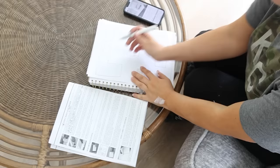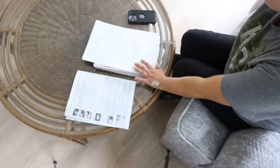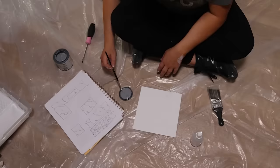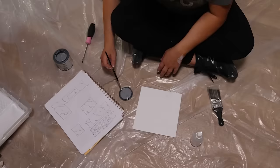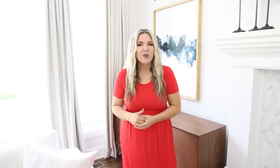While you're waiting for your primer to dry, this is a great time to research different marble pictures on your phone to figure out exactly the type of marble that you like. I actually drew out how I wanted the veins to look on my countertop. This was a really important step because it gave me a guide when I started putting the veins on. You definitely want to practice putting the gray veins on ahead of time — I suggest doing that on a scrap board just to get the technique down.